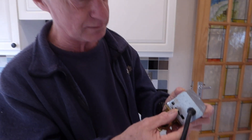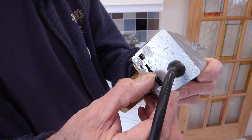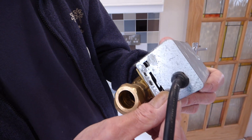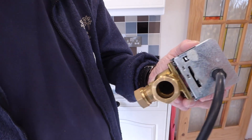So when you want to drain it and get all that water out, it is a right hassle when you have this side blocked. So we use this lever to put it into manual mode. Look on the side of your valve — there'll be the lever. Pull it over, lock it, let it drop back, and it will lock in. It's now in manual mode. When you drain the heating now, it'll all empty — it'll be wide open to let that heating water out and let that system drain, and you'll get it completely out.